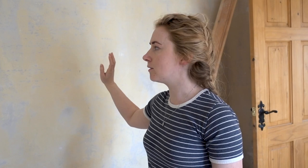In my last vlog you might have seen that I was sanding down some of the walls in one of the spare bedrooms, because we are going to start painting this weekend — I'm determined to start painting. So I sanded all of that wall down in the small spare room. Hopefully we can start painting today; I'm just waiting for my mum to come around to help me. I just wanted to explain — we needed to sand these walls down because after getting off all the wallpaper, the surfaces were a little bit bumpy. If we painted on them straight away, those bumpy textured bits would definitely show up with paint, so they needed smoothing down first.